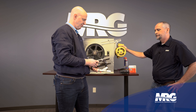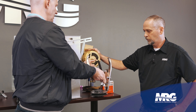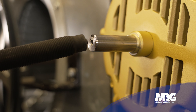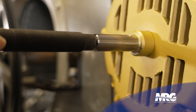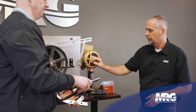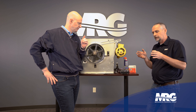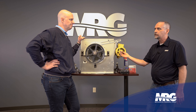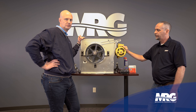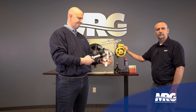On the three-jaw, you want the center all-thread bolt pressing directly only on the shaft — not against the end of the pulley. See how that shaft has got a little divot in it? They put that there just so it'll seat right in there, because you've got to have it centered. If you don't center it, you're pushing against the wrong surface. On a larger motor with a shaft that's an inch or more, if you're not centered on that motor shaft, it's going to pull the sheave at an angle, and it's going to damage the sheave and probably the motor a little bit too. So that's very important.